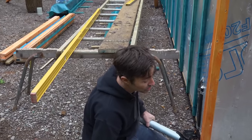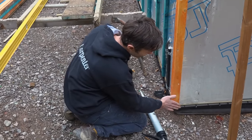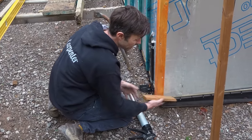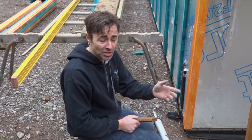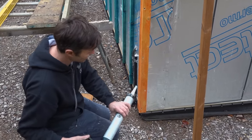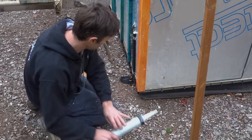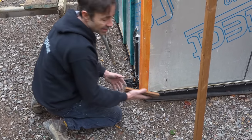It gives it a little bit of flexibility. One thing I'll also do as well, when my bottom row of cladding goes on, against my vent strip here, it's designed to fit exactly over it, so there's no space. Timber sometimes undulates. So if there's any undulation there, what's prudent is, I'll also go along with a line of this here, bottom row of cladding, bedded against, and then I'm completely sealed from those insects and other things that want to get up inside.